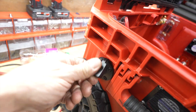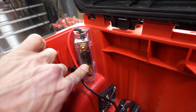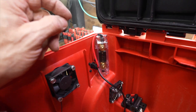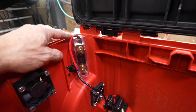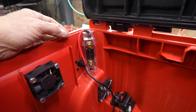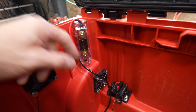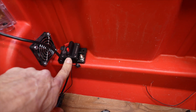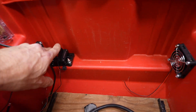In this corner is the solar input — there's an SAE plug there — 10-gauge wire going into a 30-amp fuse. Now, depending on the literature you read, the electronic PDF version of the manual says the inverter will take 60 amps of PV in, the paper manual says 40 amps, but the cheap Chinese aluminum wire says 30 amps. There'll be a 30-amp breaker down here — this is a 40-amp, but there will be a 30 there. I know it's redundant, but peace of mind.